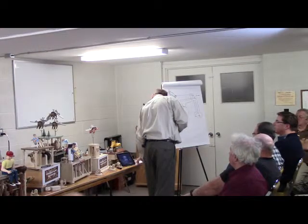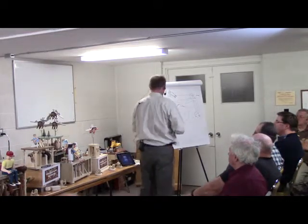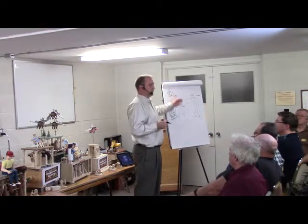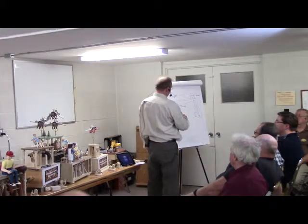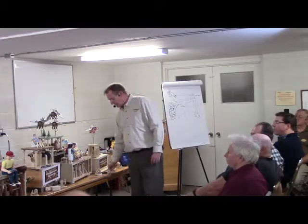Four bar mechanisms are the other big chunk of automata. When we talk about mechanisms, cams are the number one thing in terms of making, because you're converting a rotary movement into a vertical movement a lot of the time, right? One of the other ways to do it is to make this thing have a string on it. In fact, if you look in the back of the fishing boy here,